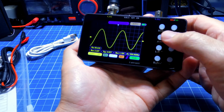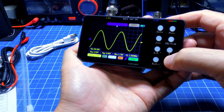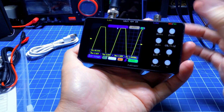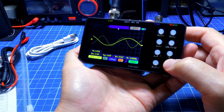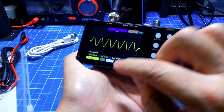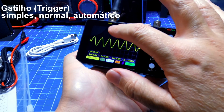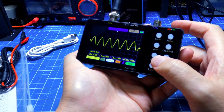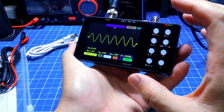I can navigate left and right to change options. For example, in the position setting, pressing more or less moves the trace up and down. Going a little further right, I adjust the voltage division — I can have 500 mV or 2 V. Here is the X1/X10 probe setting. Here is the time division — I can increase or decrease it and it responds very well. Then I have coupling, then trigger level up or down, trigger position, trigger type, and the vertical position on screen. It is very easy to navigate.